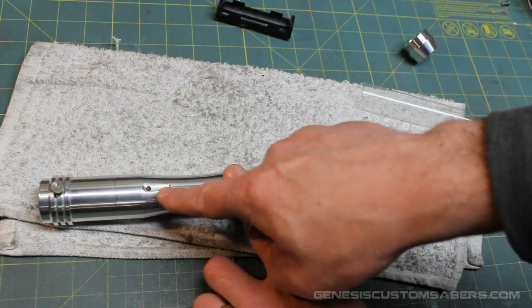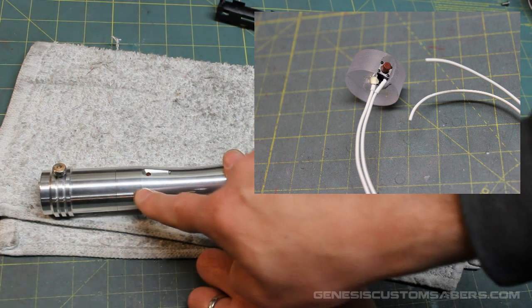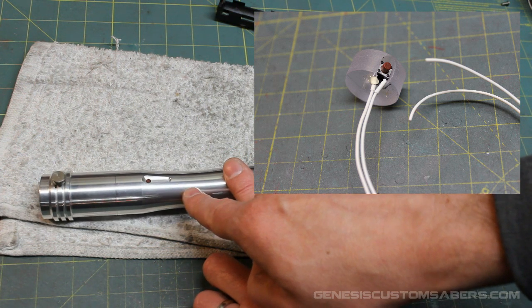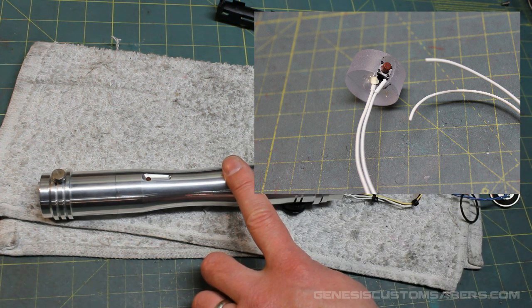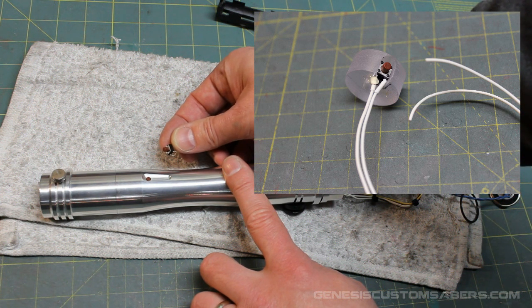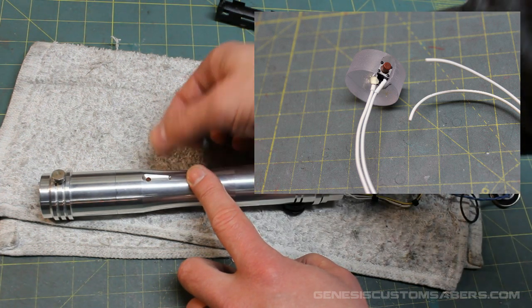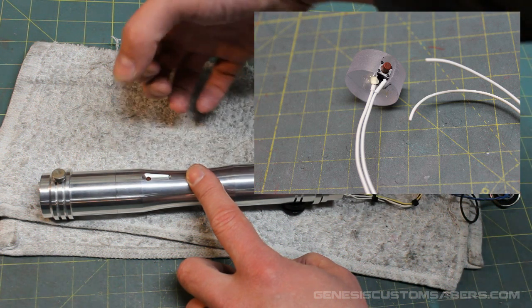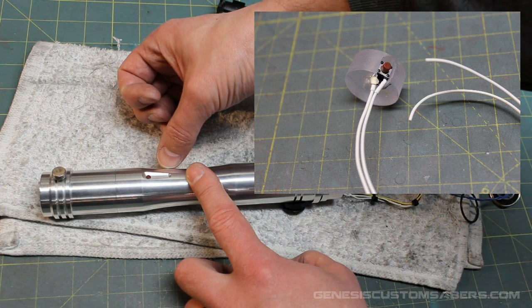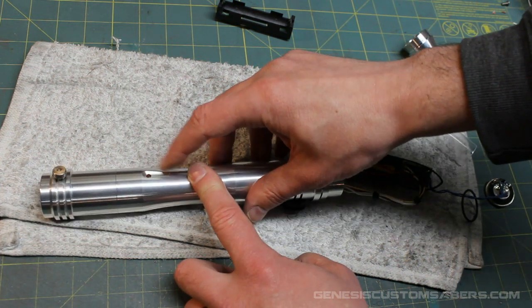You'll notice there's a milled flute I did there. What I've done — and I'll show you a picture — is I machined a plastic slug to slide into this section before I put the blade holder on. In that plastic slug, about an inch long and an inch in outside diameter, I milled a quarter-inch slot that I could fit a little tactile momentary switch in. I use these tactile momentary switches with the Ascend and the Bad Axe. At Custom Saber Shop they sell a similar tactile momentary switch with a longer plunger that you could use and maybe cut down. I milled the slot, seated the switch inside with the wires and a couple of layers of foam underneath so I can compress the switch to slide it into the tube, and then it pops up through the hole just enough. It was a little tricky to get it to sit right, but once it's in there it works really well.